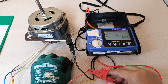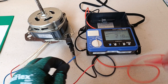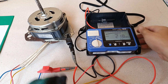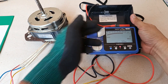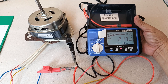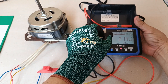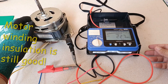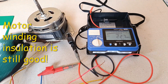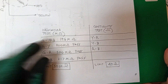Now for the ground and the blue wire — 216 or 217 mega ohms, already a good value. So this means that the insulation resistance of this motor is still intact. Here's the result of my test so far, and these are good values for insulation resistance.